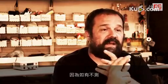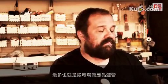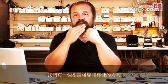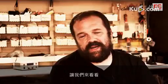It protects us because if something happens, the MOSFET blows up at worst. But using the diode, the way we hooked it up here, we can actually protect the MOSFET, and we have a fairly reliable and robust way to turn on and off, and even change the speed if we want, of this DC motor. So let's look at how we can build this circuit.